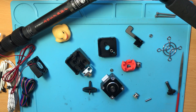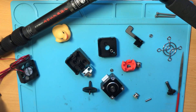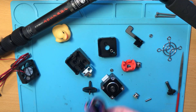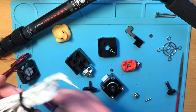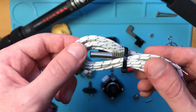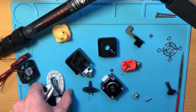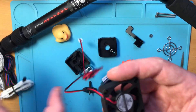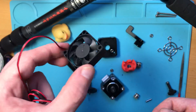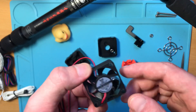Starting with the electronics: it comes with a wire for the stepper, a 40-watt heater cartridge, a pretty standard thermistor, and a 24-volt fan. I wasn't able to confirm whether the fan uses a brass bushing or bearing assembly, but we'll find out eventually.